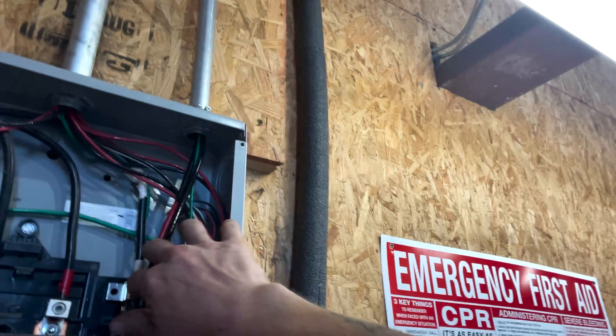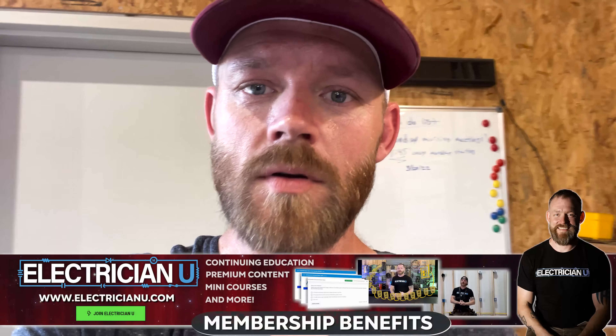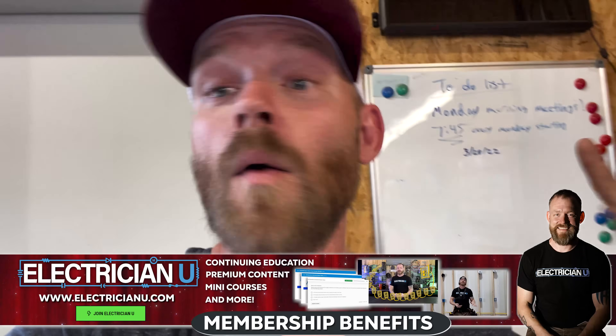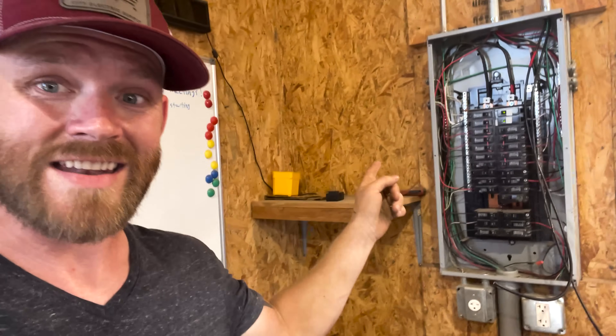My wires are sitting here, so what I want to talk about is not hooking stuff up while somebody else is working on equipment. A lot of people would be like, 'I'm really careful, I'm not going to worry about it — I'll just hook this up to the breaker, I won't touch the breaker, I'll leave the breaker off, and when he tells me he's done then I'll go turn the equipment on.'